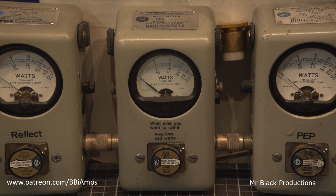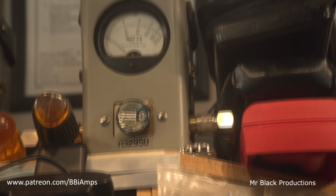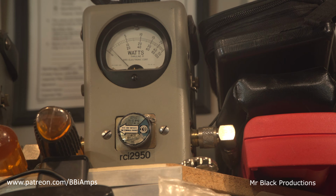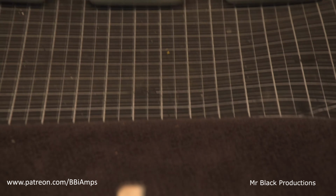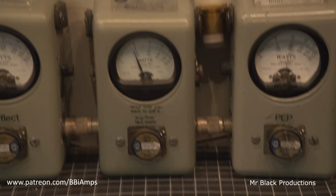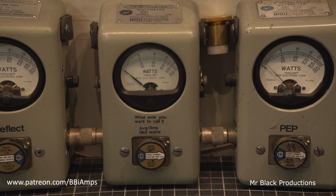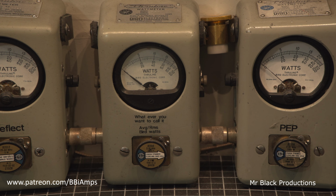Turn a 5-watt slug around. Turn on the power switch on the box. And with 1 watt going in, we have a 30-watt carrier, and almost no input reflect. Hello, 1, 2. Oh yeah, it's working fine. So we're getting 500, 400 watts out of it with, hello, audio, 1, 2, with our 20 watts worth of drive.